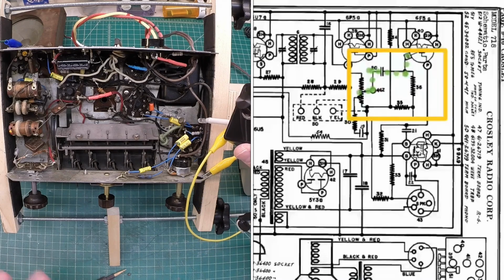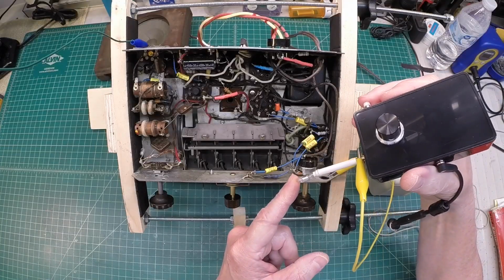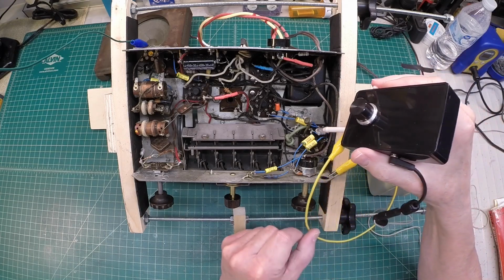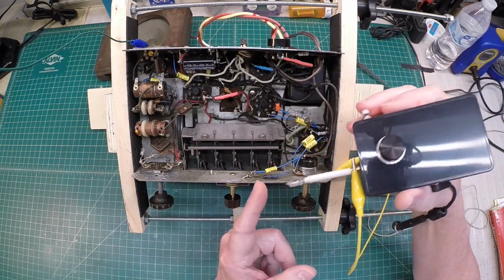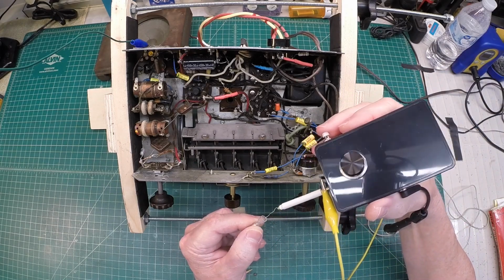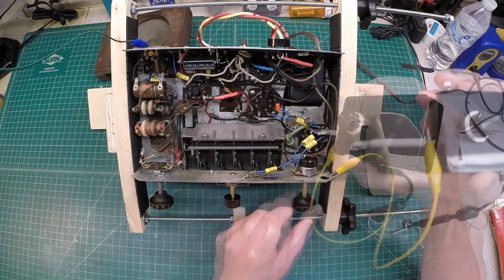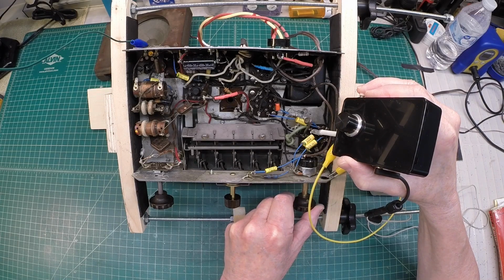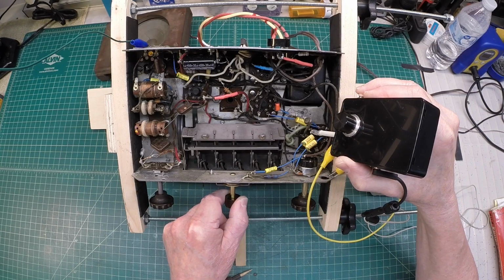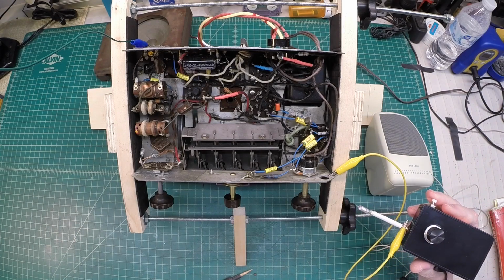So let me go here now. I'll have to crank up the volume control. But let's see what we've got here. And in this case, you'll notice I've got the capacitor in. Again, this is more of a low impedance point that we'll be testing, so you'll get better results in most cases using a direct connect here without the capacitor, or in this case again I'm going to place the little 55 picofarad capacitor here on the end of the probe. That's with the volume down. So you're hearing both sources, of course, the loudspeaker here as well as the signal tracer at this point.